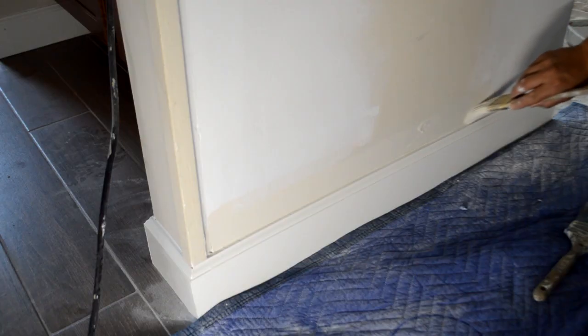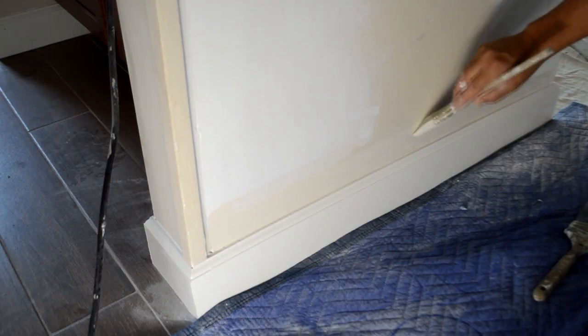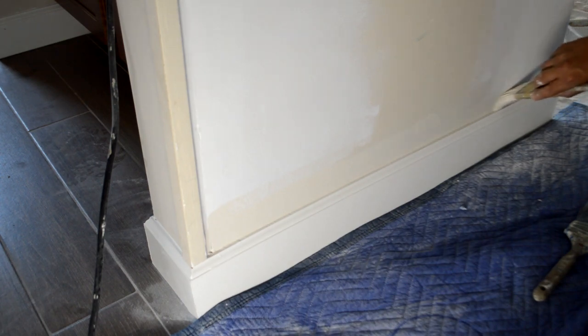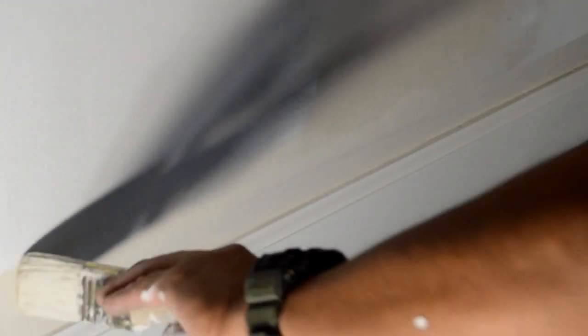The most important thing when you're doing cutting is that if you don't have paint on the surface, you're going to finish your little line every four or five inches because you run out of paint really quick. And if you put too much, you're going to drip onto the other surface — in this case, the base molding. Those are ideas and techniques that I always use, and that way you avoid all those issues.